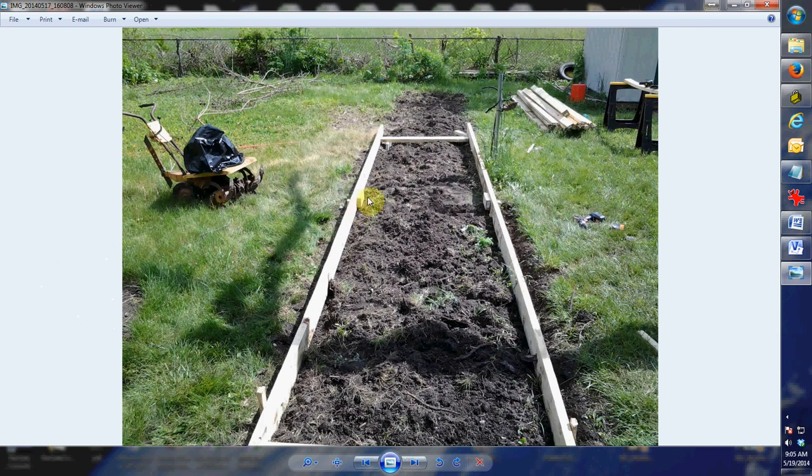And then this is just a little piece of 2x4 here to hook the two 2x6s together. And then I've come down to the bottom. I've put that other 4-foot 2x6 in here again. You can see I cut a couple pieces of 2x4 just to work with too. This one's propped up and I'm getting it leveled out. I still have to level out this one here, but then I'll put more posts in at the end and get that all level and make sure it's squared up.